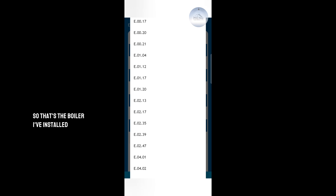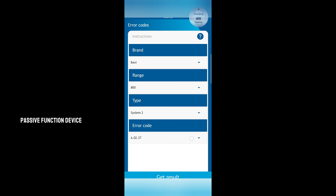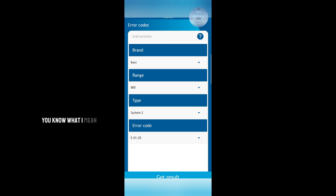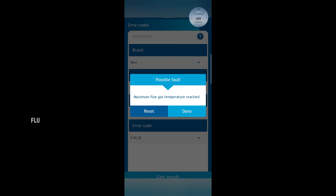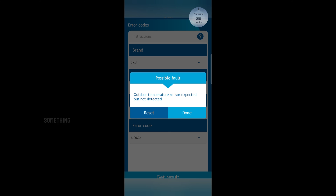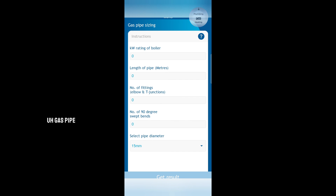With a lot of apps there's just menu after menu and you have to hunt around for stuff. I just love the way Baxi makes it so easy to find anything. So that's the boiler I've installed just recently — let's say it comes up with a fault and I want to find out what that means. 'Get result — PCB setting cannot be read.' Let's see what something else means: 'Passive function device discontinued or disconnected,' 'no water circulation,' 'maximum flue gas temperature reached.' So then you can start looking at flue sensors or a flue sensor. 'Outdoor temperature sensor expected but not detected' — that basically means there should be a sensor there but none is detected.